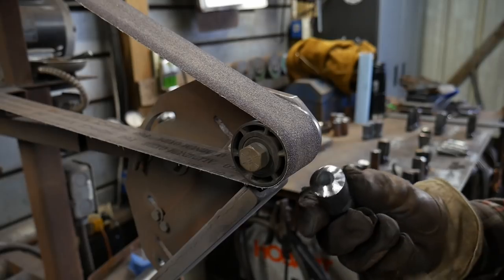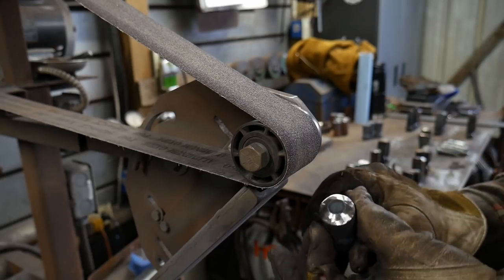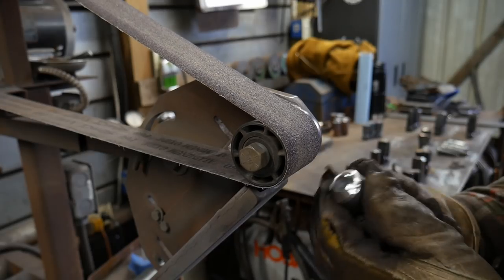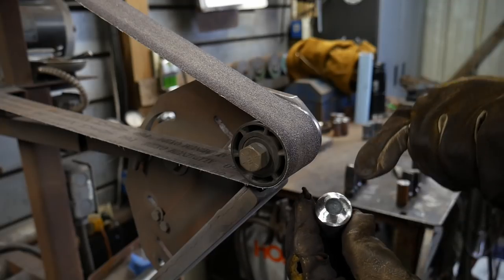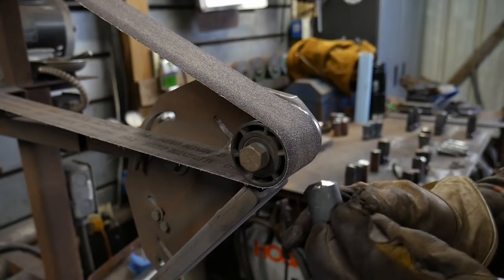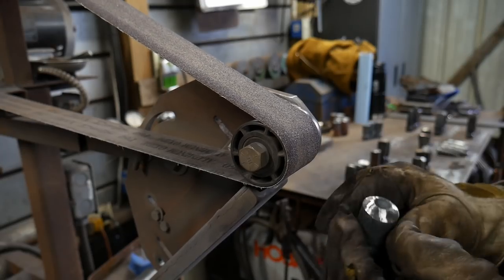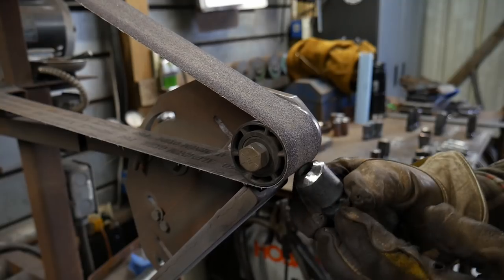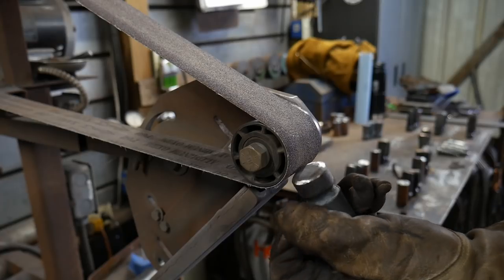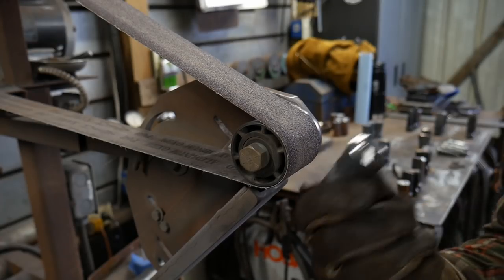So now I hope you guys can see the advantages of this a little bit. So we were just holding it and letting it take its own course, working it back and forth until we didn't see any more shouldering up near the eye. And again, we've established what is about a 60 degree angle, and we kind of alleviated off that sharp edge out the edge. And then this is what we came up with for the rear end of the tool. Now this piece here is ready to be heat treated.